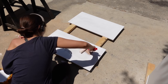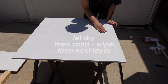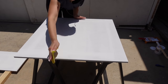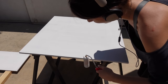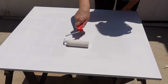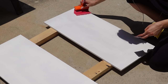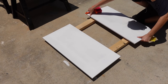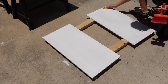Another thing to keep in mind when painting MDF is that it's a good idea to prime both sides, because the porousness of MDF means paint can easily seep through to the other side. You can prevent this by applying a couple of coats of primer to the back side even if you're not painting it. It's also recommended to apply at least two to three layers of primer — I applied three. I'm using a foam roller and also sand lightly with 220 grit sandpaper between coats, which enables better adhesion and a smoother result.